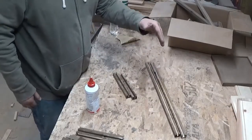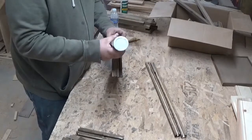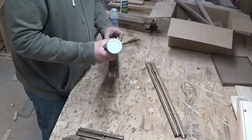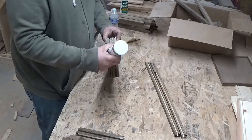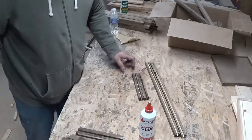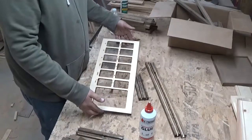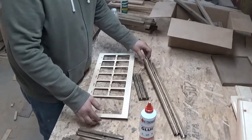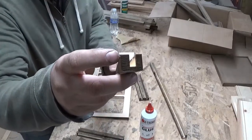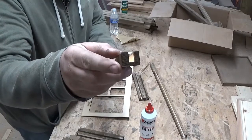Leave those facing up so the glue drips down into the groove — and these are the sides. Now I've got this assembled, and if you see here I offset the groove so the back side is thicker, and that's to allow for a mat and your points and whatnot to hold the pictures in.